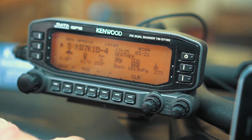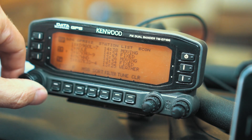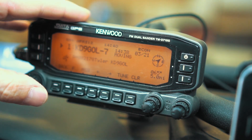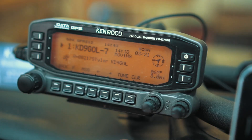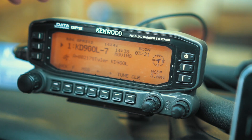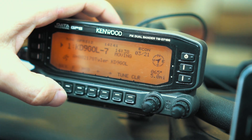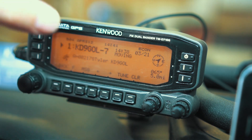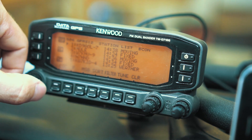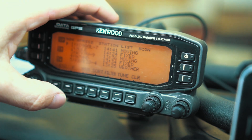This is great — we use this all the time when we're out. We'll wake up in the morning and look at the weather stations within earshot, and a lot of times that helps inform which way we want to head for the day — do we want sunnier weather or colder weather with less wind, etc. With all these different packet types, it's really easy to hop on your radio and see what's around you. With location packets, there's also a way with this radio and most others to hook up a tablet that shows a map with a pinpoint for every location as it's updated. That's really handy on a convoy — if everyone has APRS radios, you can see exactly where everybody is. We've used that on longer trips where we have to split up, sometimes 40 to 50 miles apart, using the radio to see where everybody is and coordinate meetup spots.